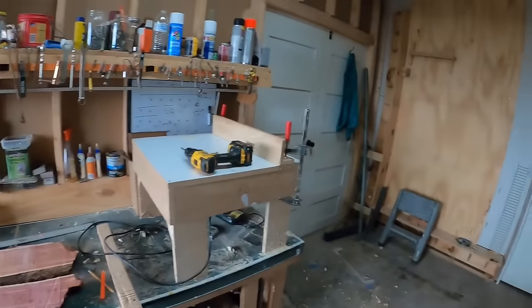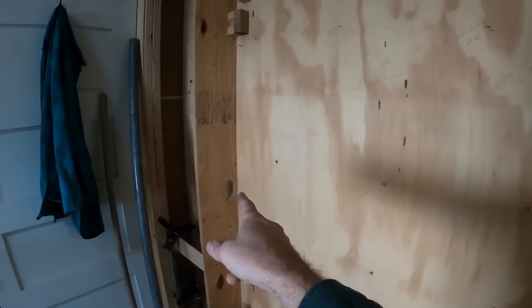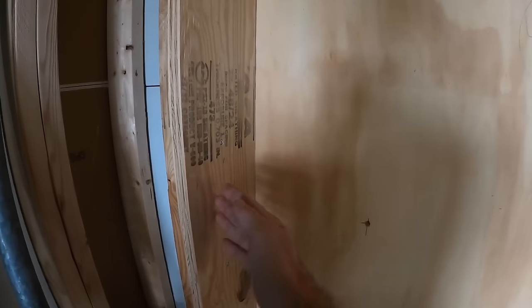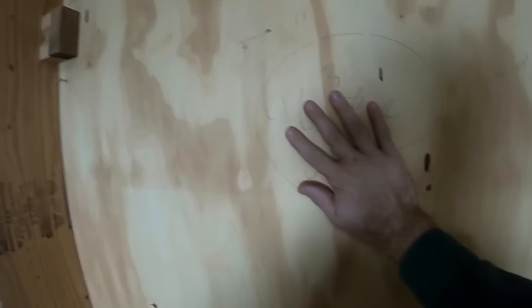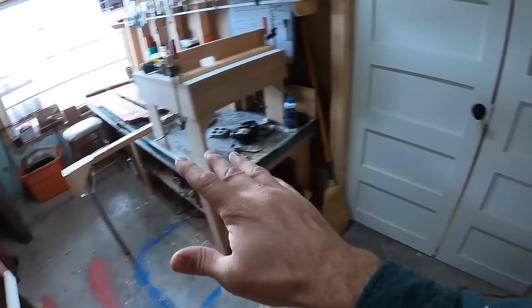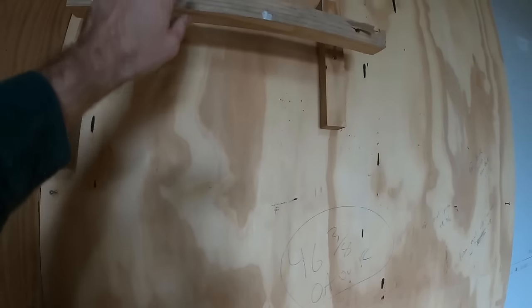Just basic hand tools. This is probably my favorite thing — a four-by-eight sheet of three-quarter ply. It comes out here; you can see what we've got going down the side and across the bottom. That's perfectly square this way, and these are perfectly square coming off of it. I took the time to make sure this is perfectly planed. This is where I build tabletops, cabinets, anything like that — it's just a big clamp jig. I don't have a lot of room for a big workbench, so we just went vertical with it. Anytime I need it, I can just screw whatever I need to this, drill holes in the side for a clamp spot. It works pretty sweet.